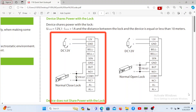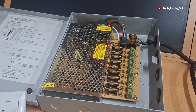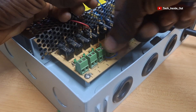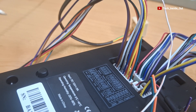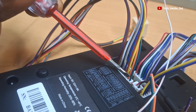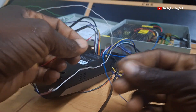When you look at the diagram, there is a 12V and a GND shown, which represents the power supply unit. For that reason, we will be using this 12V power supply unit. We need just one of the pairs of the power supply unit, so I'll put a cable into the positive here, and that goes to COM on the access control terminal. COM is the 4th pin from the top, which is the red cable. So we'll join the 12V to the red cable, which is COM.